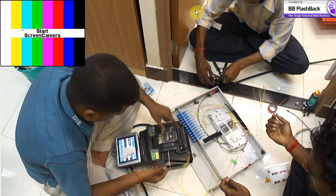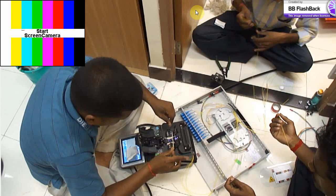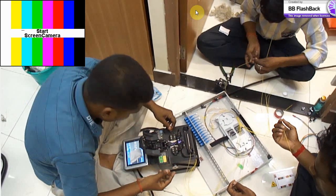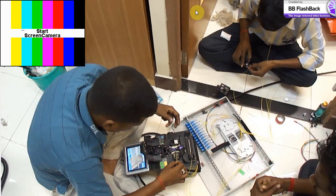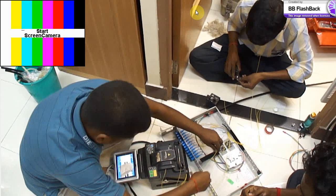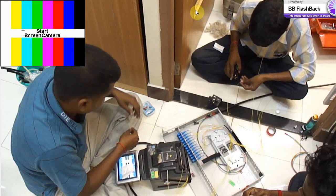Using the cutting machine, we apply a 90-degree cut to the fiber for a good joint. We are now putting it on the heater. The other joint is taking place, and between the two fiber pieces there will be a hairline gap. When the fusion technology is applied, the machine takes care of the gap and the fibers get joined.